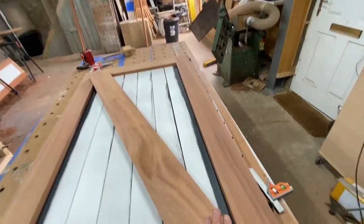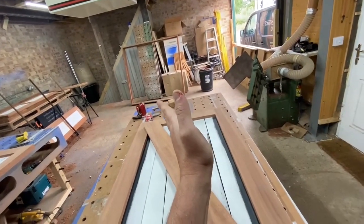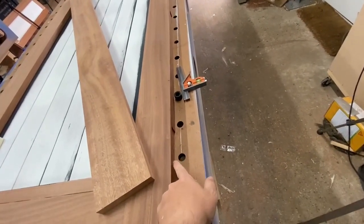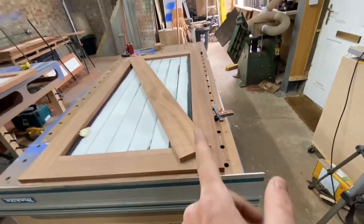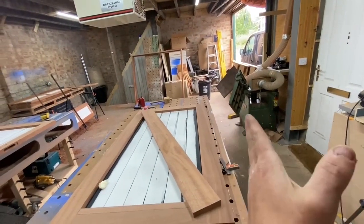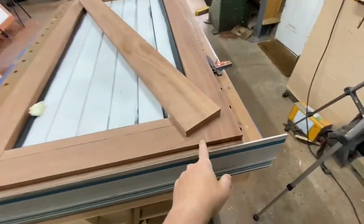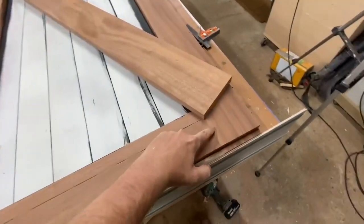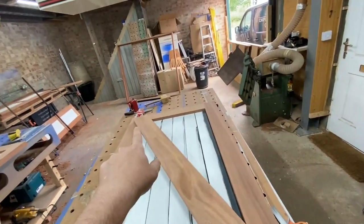Ideally, you really shouldn't have this at less than 45 degrees. The brace needs to be standing upright, more than 45 degrees, and it needs to be going back down to the hinge corner. This is the hinge side, so I've chopped out the hinges, and basically that hinge side's never going to drop because it's fixed to the frame, but that top corner and this bottom corner could drop, because over time there'd be too much stress. If you imagine all the weight of this door is being held by these joints and that joint up there, what you want to do is transpose the weight